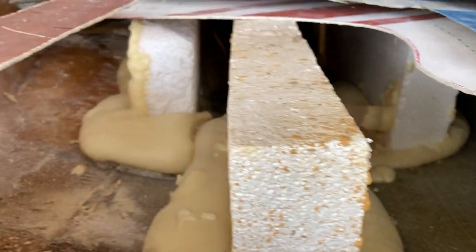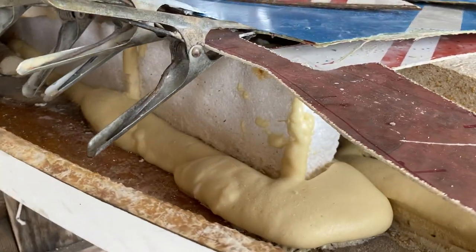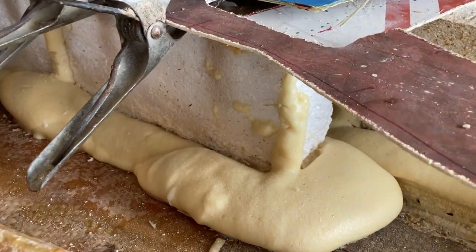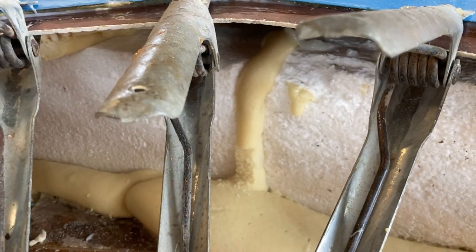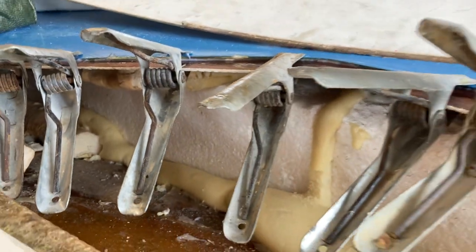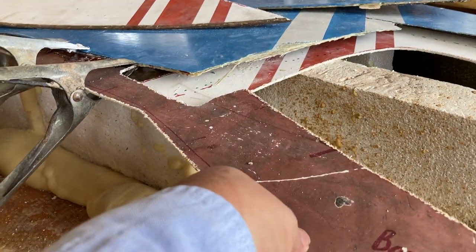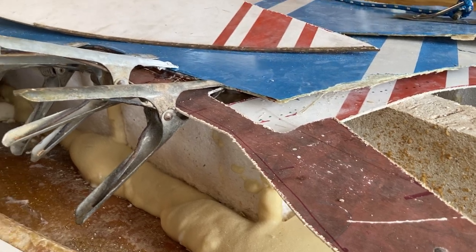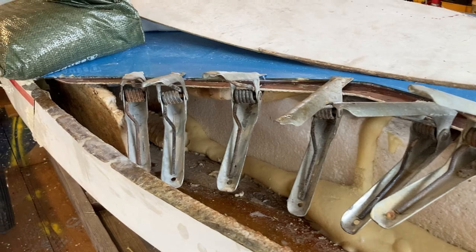And the starboard side block, the forward half, or forward one quarter or so, had sheared off during the storm. So we re-poured the bottom, put some foam in between the two pieces, and poured a little more on this outboard side. It's one of the backer strips we cut out of pieces from Sally, the other boat that's partaking in this restoration.